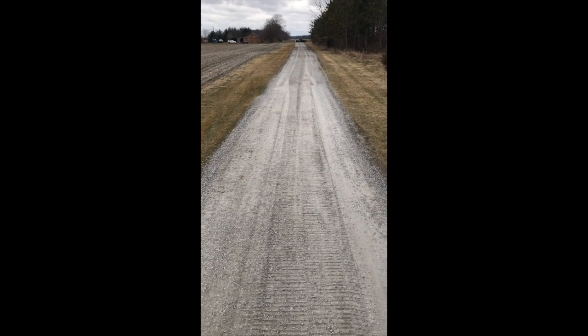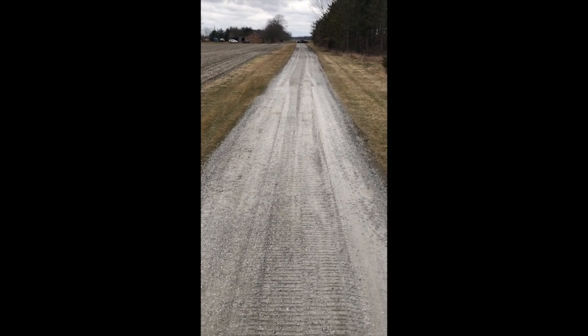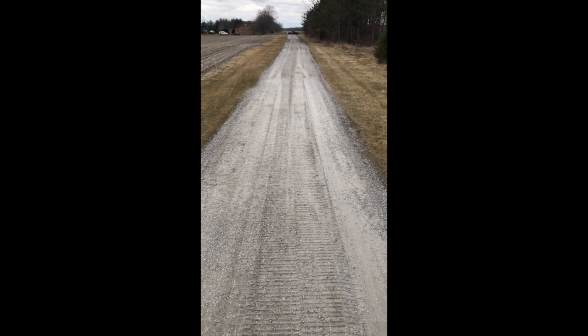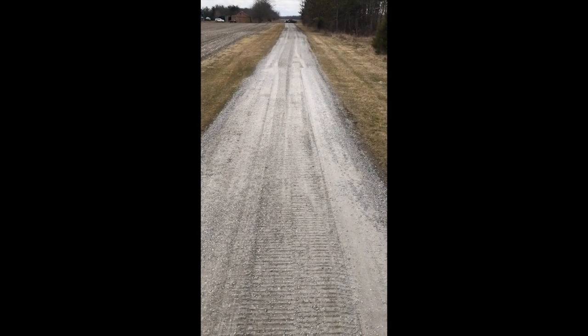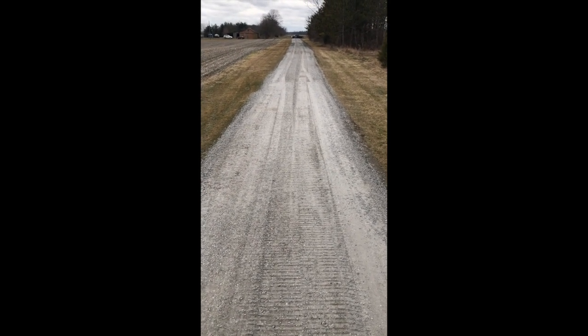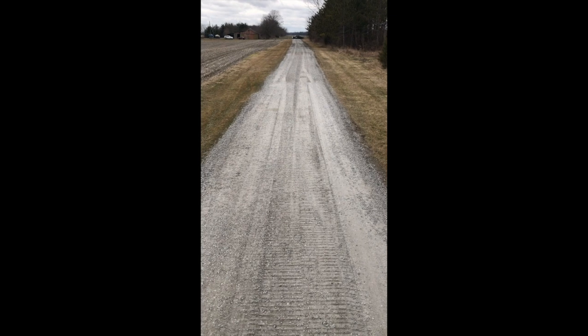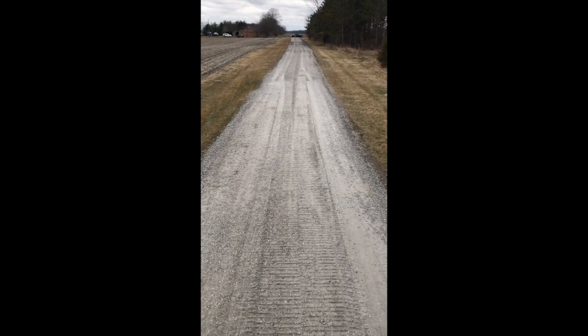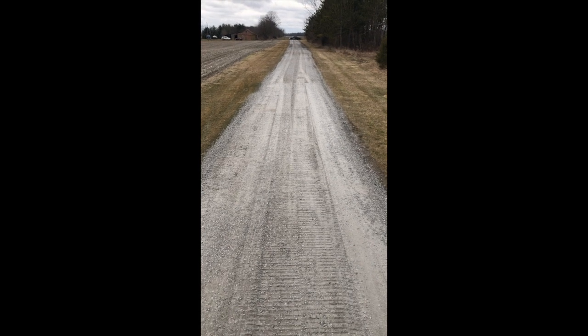Well, here it is, all completed. Got the material on there, packed down. It'll continue to pack. This is Duraburn slag. It goes a lot further. It's a lot better quality material. A lot of folks will use 73s, which is crushed limestone with powder, about 1 inch minus. And it's the same concept with that. This is just better material.